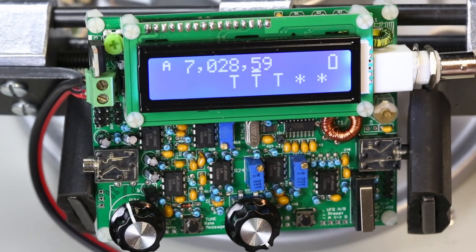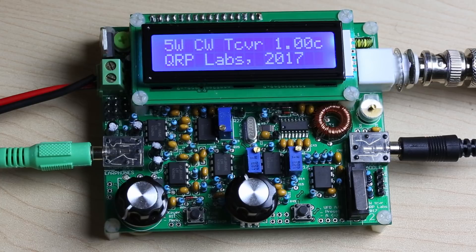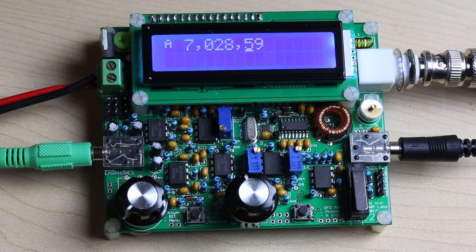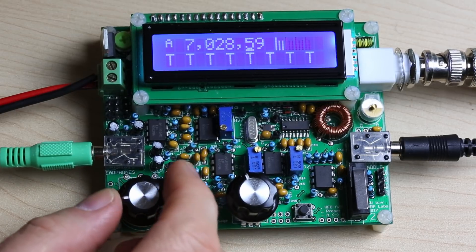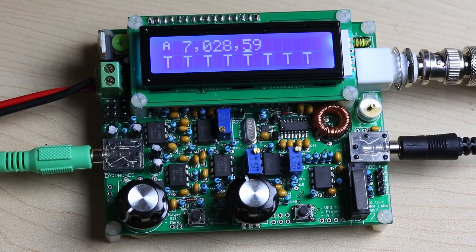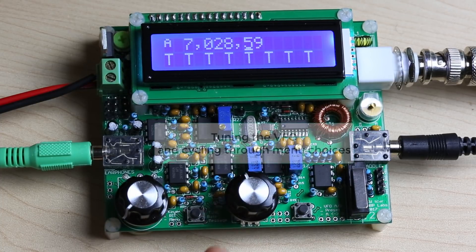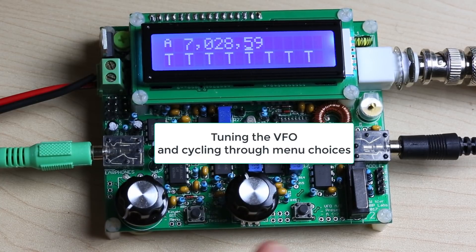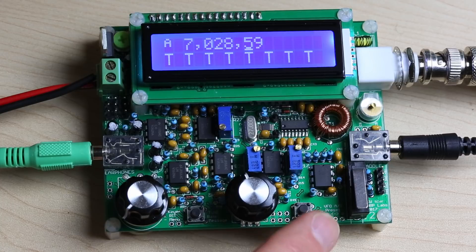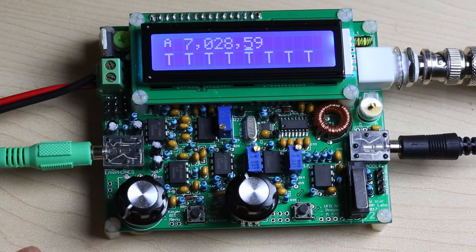Now I'm going to show you how to use the radio — just the basics. Let's put this thing on the air. There's a little splash screen and now we're sitting here ready to go. This is the AF gain knob, so that's your volume control. Then there are three other buttons. There's a small switch used to select things mainly, a rotary encoder used to cycle through menu choices, and a third button that's a momentary switch to exit. So: select, move through selections, and then exit — that's kind of how to think about it.